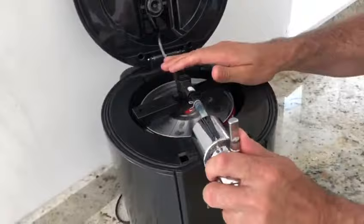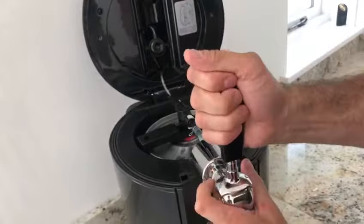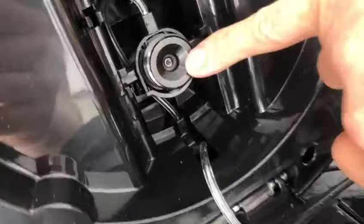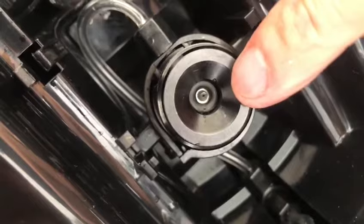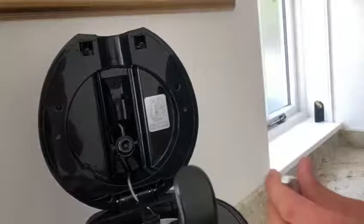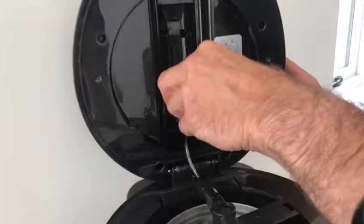We get our handle which clicks in there. Now this is where the gas goes — this is your CO2 sheath. If you look at the back there's a rubber seal; you will have two or three spare ones that come with your machine. When these seals go they will need replacing. Sometimes they go when you undo the gas sheath while it's still full — it freezes and causes it to split. So don't change your gas until it's empty.